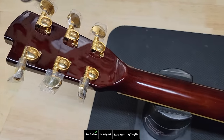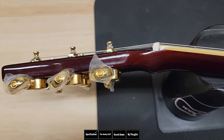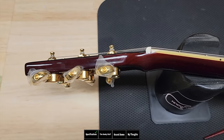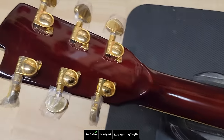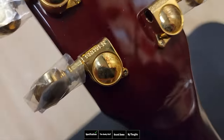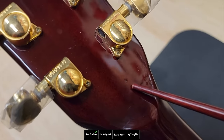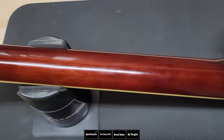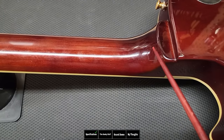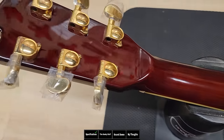Looking from the side profile, it's not a 17-degree angle — it's a 13-degree angle, maybe even shallower. With that volute, it's going to be a very strong neck. I don't see any scarf joint at all, and I don't see a multi-ply neck — which would be a good thing. There is a little defect where they painted or cleared over what looks like a small divot without filling it. The neck construction looks like all one piece — a pretty significant block of mahogany — and with that volute, I think it's going to be a good quality neck.